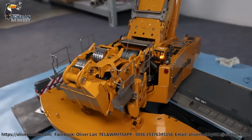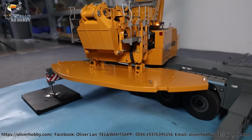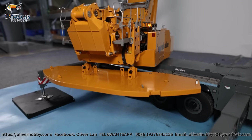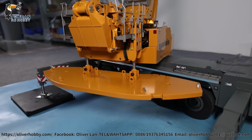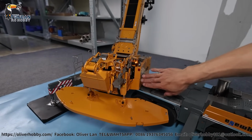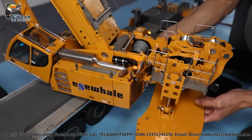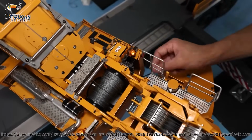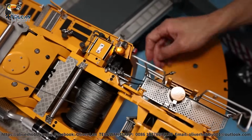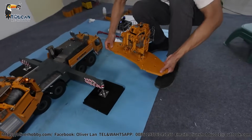It's rising. So inside now the cylinder has oil, has air. Move a few times to push out the air. So now in top position, after sitting here, we'll be able to turn the rear side of the crane to align it. So first time out of the box, have to do it manually to raise it. Now we will disconnect. Also the hose, this one disconnect. A little bit of oil is coming out. Disconnect. Then we remove this weight block. So the weight block we will put here.